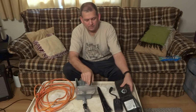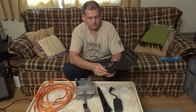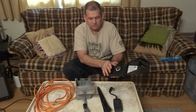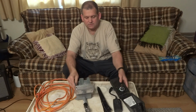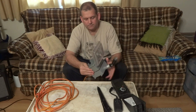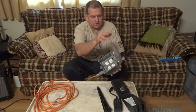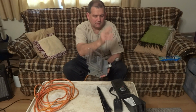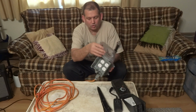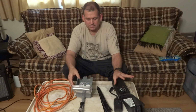So in other words, if I want to turn my water garden off at 11, it shuts this, turns everything off. Then at 5 o'clock I have this turning on, and it energizes this, and since it's dark outside, this will turn this on, make the connection, and then it will turn these two, which will turn all my lights on. Then once it gets light, of course this will disconnect, and it will turn these 2 outlets off and keep my pumps running during the day.